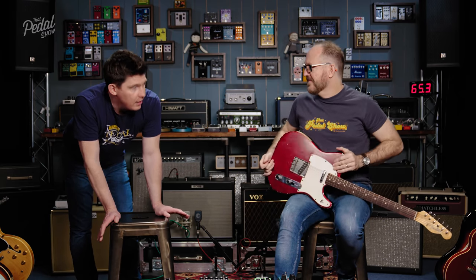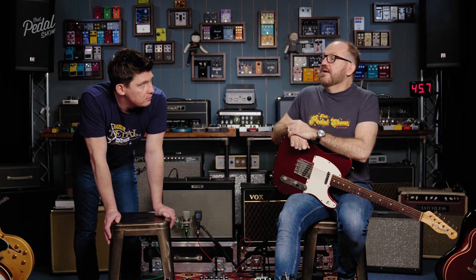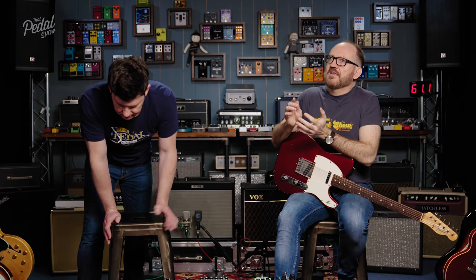In a large way, that defines the Vox sound. Absolutely, to me, when it's cranking. Now that's not to say that if you take out the negative feedback circuit in every amp you'll get that, but as part of the Vox design, without that is when it all sort of blooms and comes to life. So I adore that sound. The AC15 sounded good today, didn't it?